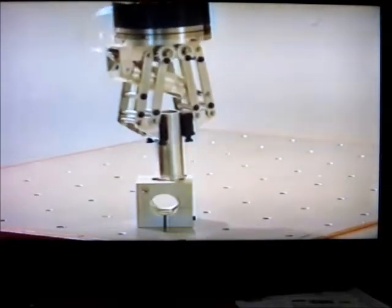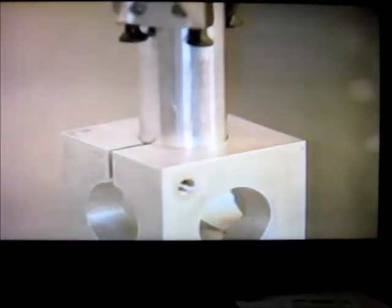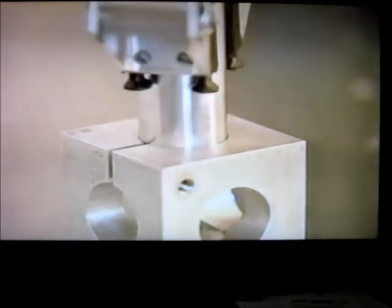Here, we show the Zero using force sensing and control to perform our sample task of inserting a shaft into a hole. First, we use the force sensor to detect when the shaft is aligned with the hole. The active force servos are then used to maintain contact while righting the shaft and to prevent jamming as the insertion is completed. As the task is repeated, we can see how the force control techniques are tolerant of significant misalignment between the shaft and hole. The Zero's ability to compensate for such sizable misalignments of parts can drastically reduce the cost of robotic assembly systems.